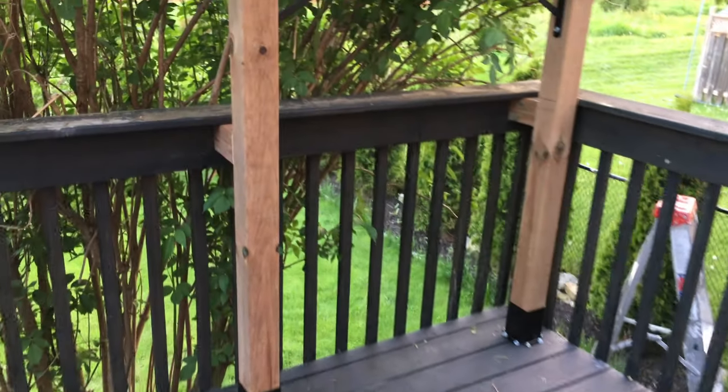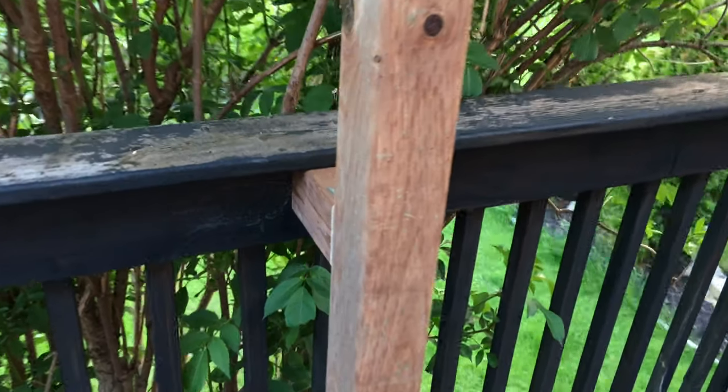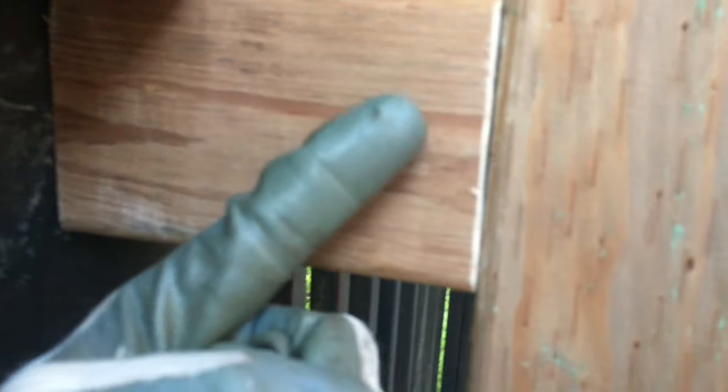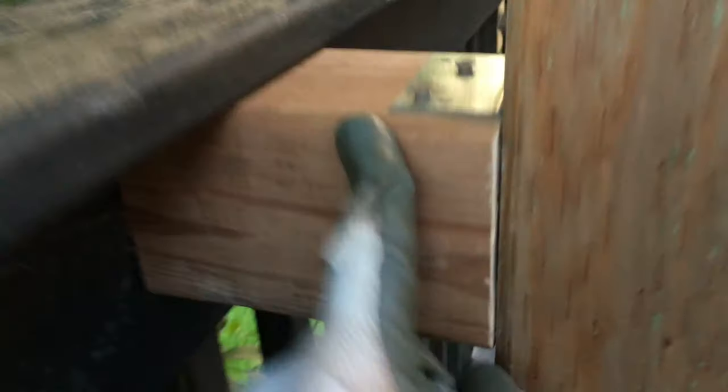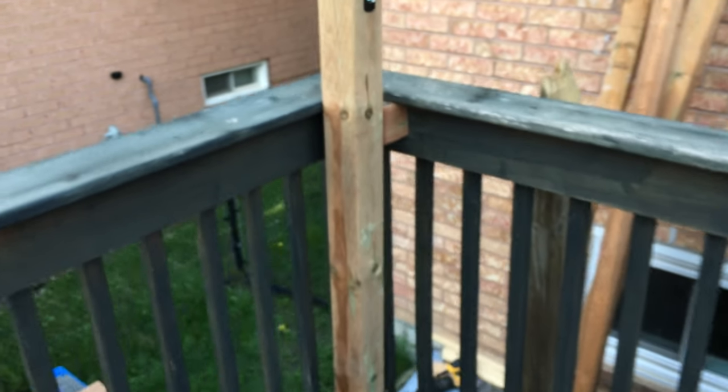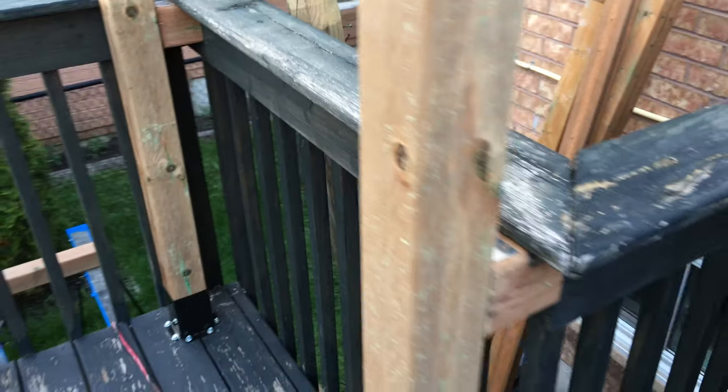Something you'll want to add as support are these beams right here. We placed them and, underneath, instead of plates we just drilled screws in sideways — the screws are going sideways into the wood. We did this all the way around. You can barely see it, but the screws are right there going in sideways, and we placed these beams all the way around the structure.